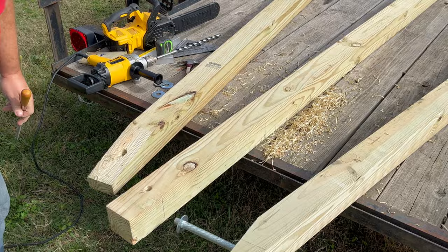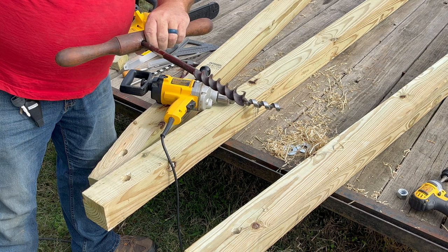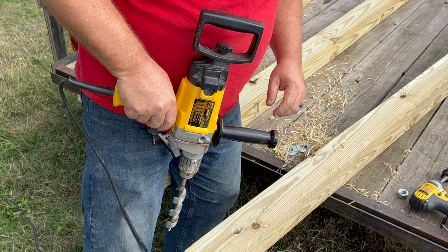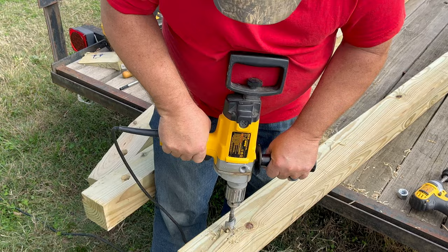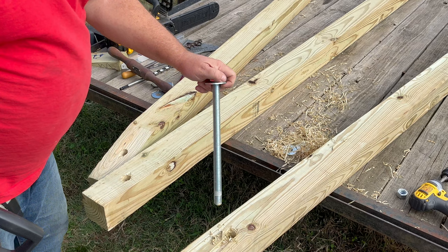All right, so the round rasp is not cutting the job. Then I decided to go old school. And what that does, it cuts a little bit about halfway through, and then it just finds a groove and it's like threading a bolt in and it's not cutting. So I had to resort to this 1-inch auger bit. And it gives me the fit that I want. And you can see it does a number on it. Didn't really want to split that wood out like that, but here's the fit I was looking for. This is what I wanted. That's what I wanted. So that's what we're getting with this.